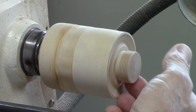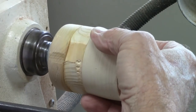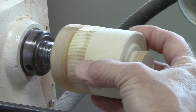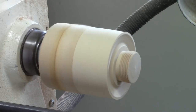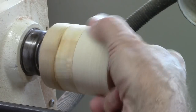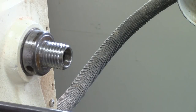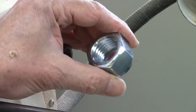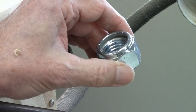In this case I glued a piece on so I could make threads on the end of a tenon. The nice thing about these is that they're inexpensive — a dollar and a half each plus about fifty cents for glue — and you can take them on and off the lathe. When you put them back on they'll always be in the same orientation, so you can count on them running true, as opposed to something you put in a chuck without marking that might not run true. I'm going to show you how to drill a hole, glue in the nut, and make a waste block chuck.